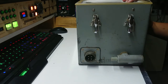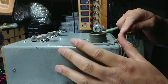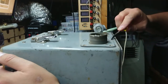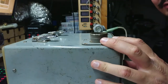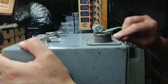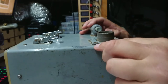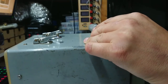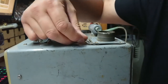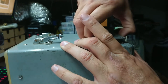Let's get it back on the bench after a clean up and attack the socket side. A few more irritating flat blade screwdriver screws later, we've removed these screws. This is clearly the plate that holds the socket in, and these are the screws that hold the socket to that plate, so I'm keen to get under that plate. The rubber seal has adhered itself, so I need to give it a gentle lift as I go around — I don't want to tear it or have to cut another rubber seal. I'm pretty sure those seals are there to stop water going into the socket if you spill any down the front.